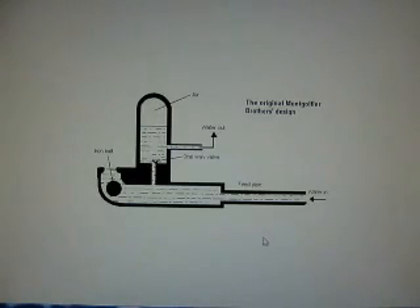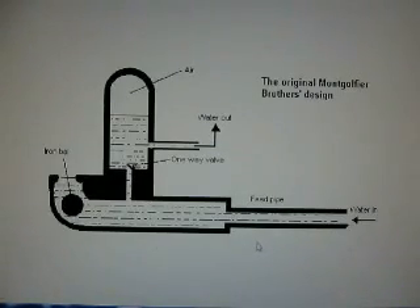This is basically the 1800s hydraulic ram pump design. This was a cannonball chunk of pipe — velocity increases enough, it slams shut here, creates a pressure spike. There's a little check valve here, high pressure comes in. Air cushions it, stabilizes things, keeps it from blowing up, and then the pumping cycle starts over. That's basically what this is, but you don't need this valve and you don't need an air chamber. So it's the world's simplest pump — you can remove two parts.